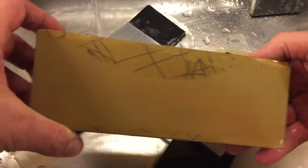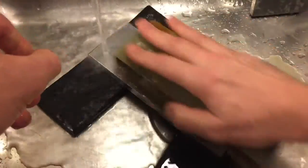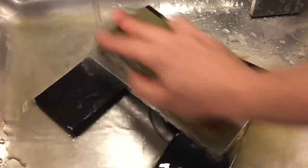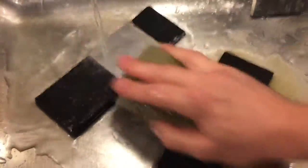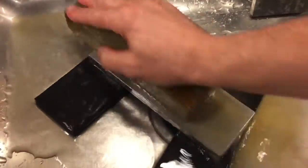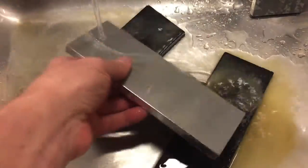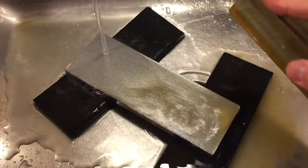You can see one side leveled out and I've got this semicircle over here, so I'll pull it around a little. The reason I have the water running is to clear away the swarf, but it's not a perfect scenario. So I do a little bit of lapping and then let the water clear through. People do figure eights — I don't do figure eights. Never understood why you needed to; somebody thought it looked good on camera.